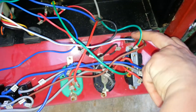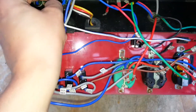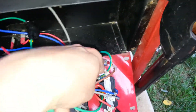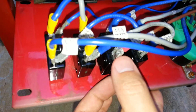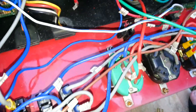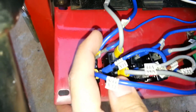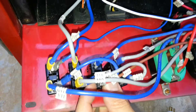Right here is your auto idle switch — it's either on or off. This is the white wire that powers the idle control circuit, and it runs over to the switch. From there, this brown wire runs all the way to the 20 amp circuit breaker, which is jumpered on the line side. You have your load side coming in, here's your main winding, here's the load side, and then the load side is jumpered to the 20 amp line side. This blue wire will go over to the bottom duplex outlet.